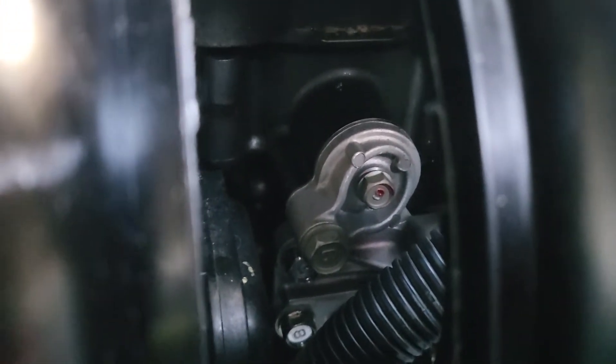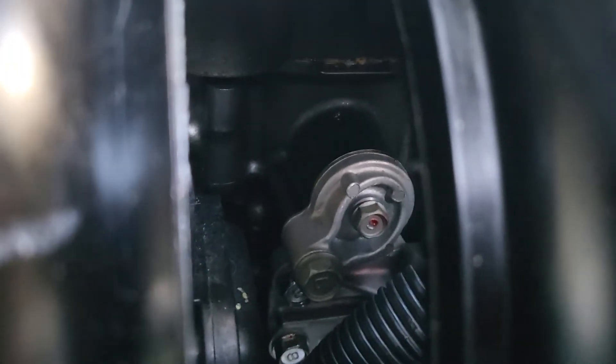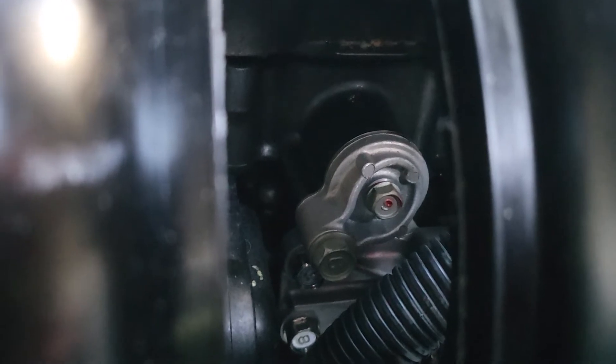You can see it's got a center bolt and then a bolt a little bit lower to the left. The center bolt is the one that's actually holding the zinc, and the other bolt is the one that needs to come out — that's actually holding all this in. It is a 12 millimeter.